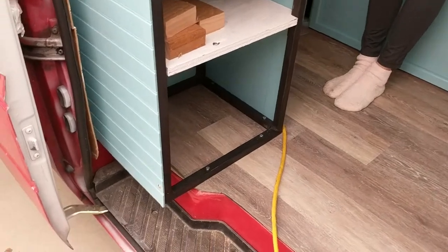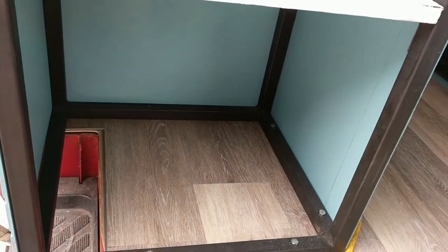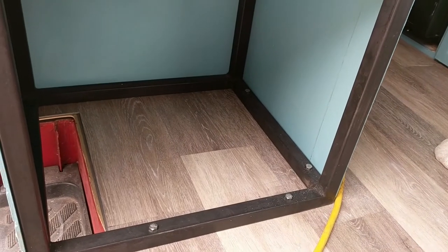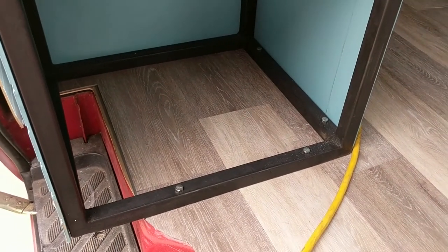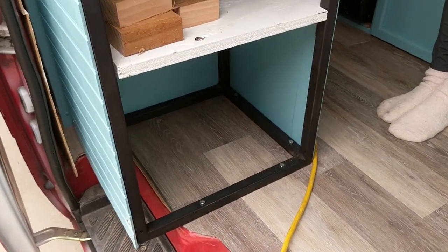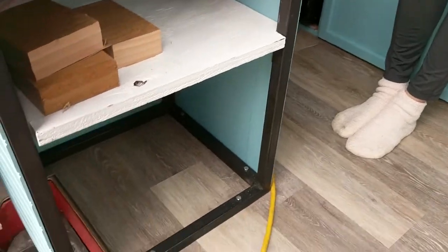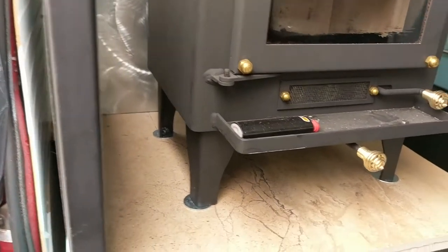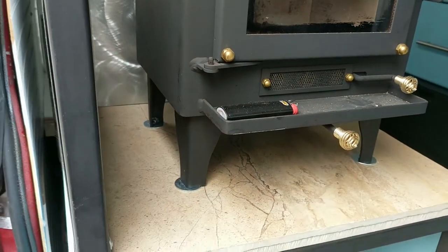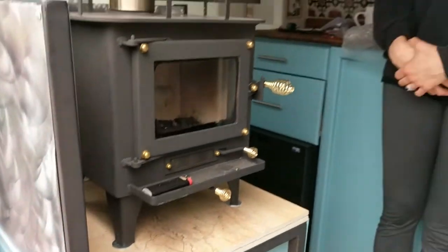We through bolted this through the floor of the van. So there's 4 bolts down at the bottom here that go through to the floor. Same kind of thing I've been doing for all the cabinets and the bed, just to make sure if we get an accident or anything, this thing's not going anywhere. Likewise, all 4 of those feet have bolts through into the frame, so everything should be pretty solid